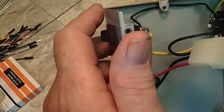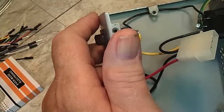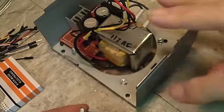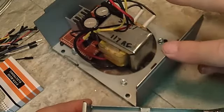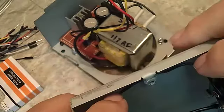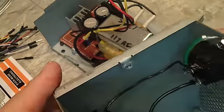Here is the mistake I made: I didn't realize that this wire running across here was going to be in direct contact with this sharp edge — that slot is cut out for the fitting right there, and the wire fits right in there. It didn't seem to do any damage to it, so I'm going to just reroute the wire, put it over here — not hard to do.